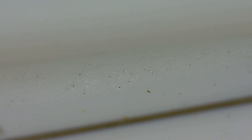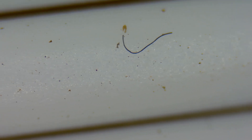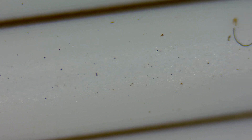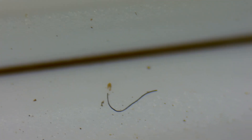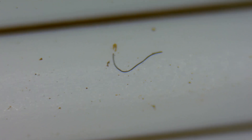There's all sorts of gross-looking stuff in here — maybe little bug mite parts as well. This could be anything from dust and dirt to particles shed off of fabrics and clothing, to human hair. The thing about all of these materials is they're going to have a much higher melting point than the filament you're extruding. So instead of melting and flowing through the nozzle, they can get caught up and clog parts of the nozzle. Particularly the tip is where it's most likely to cause a clog — you can imagine if you had a bunch of fibrous particles in there, they'd eventually form a little mesh or net that shuts off the tip of the nozzle.